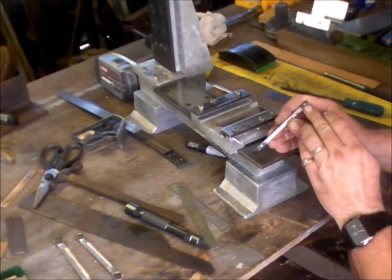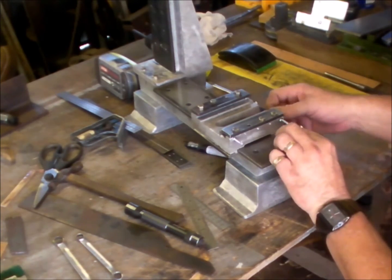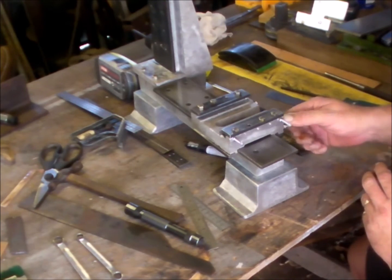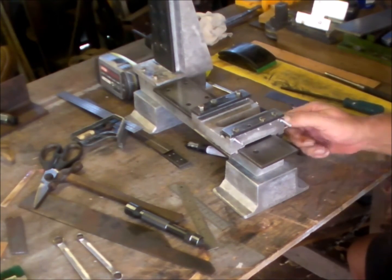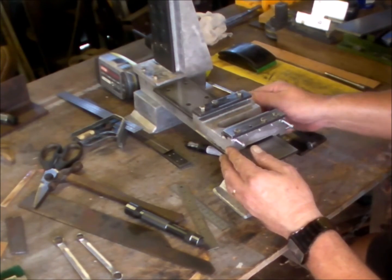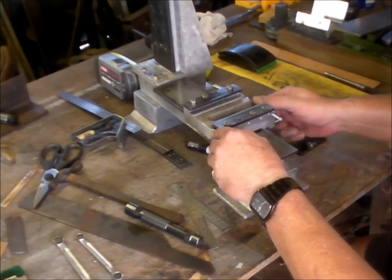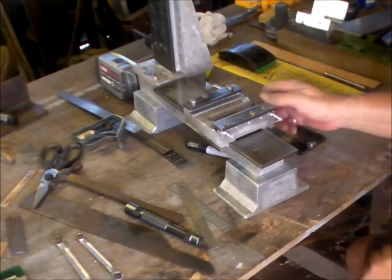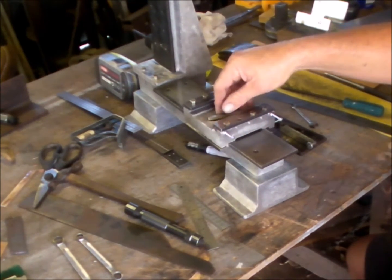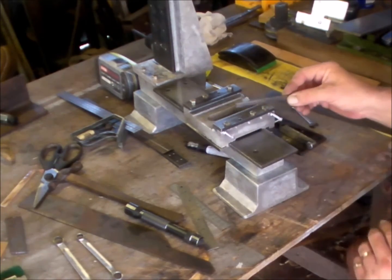I then drilled them out to two millimetres. I found out that a two millimetre drill in my drill press doesn't work — the drill press chuck won't close down that far. Anyhow, this has worked. I've got a nice slide action going on. I'll tidy up these screws and make them shorter. Off camera I'll go and spot drill this gib and fit that.